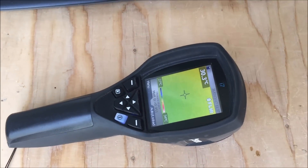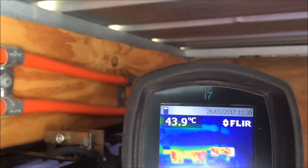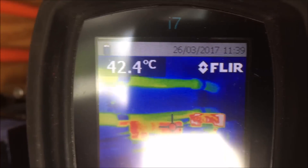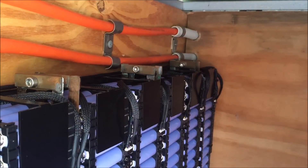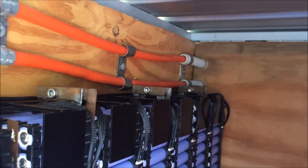With the powers of editing — both of those two connectors were done up, but they weren't done up tight enough. I've tightened them and they've already come down 10 degrees. They were just half a turn loose, and it shows how important it is to double-check everything. I should know that more than anybody else because I've done this before.